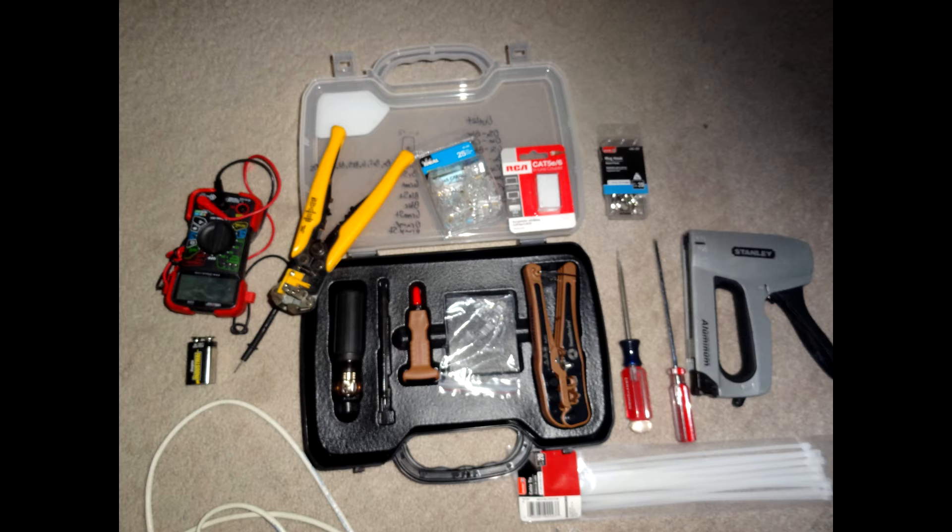Flathead and Phillips screwdriver. Of course, you're going to need some Cat5e cable. Don't waste your money on Cat6. Since your house is already wired with Cat5e, using the expensive Cat6 is just going to make you spend more money because you're not going to take full advantage of Cat6's potential, which is for speeds over a gig. It also has less interference. But with the gigabit speeds you have, you're going to be just fine not spending the extra money for Cat6, unless you actually replumb your entire house with new cable.